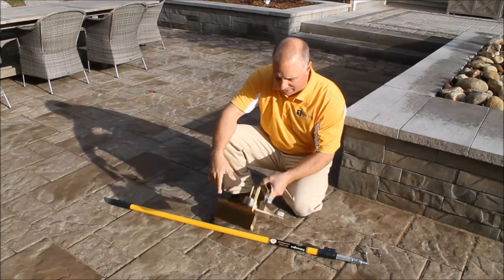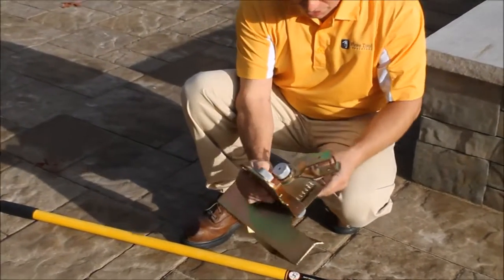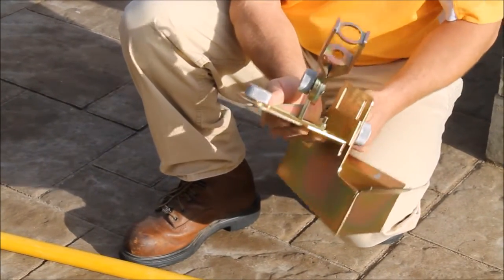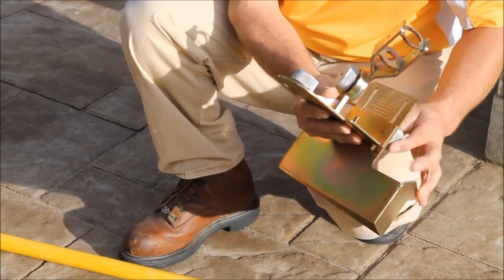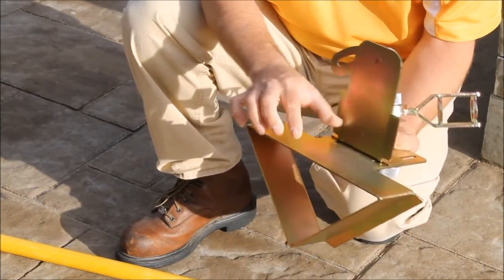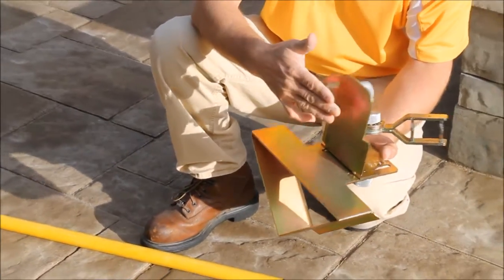To solve that, we created the sand plow and built the sizes right into the tool for whatever millimeter paver size you're doing. You just loosen it and it can adjust up or down depending on the paver. So if I'm laying a 70 mil paver I set this to 70 millimeters — that already has the paver and the sand built into it, so you're scraping just a little bit higher than what the gravel is. You can also make fine adjustments on that yourself.